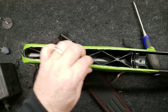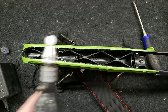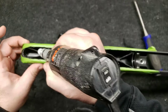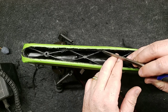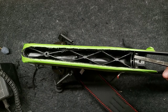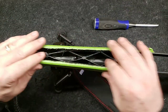Alright guys, I'm pretty much done here and ready to do a test fit. I thought I was recording but I missed some stuff. To recap: I used the cutoff wheel to get a good line down the side next to the tape, then went through and inletted everything with the ball bit — all the chambers and the sides to give myself a little more clearance. Then I went back with a chisel and took all the plastic off that was sticking up, because as you work with the ball, the plastic just kind of melts. I used a sharp chisel to get all that cleaned up.